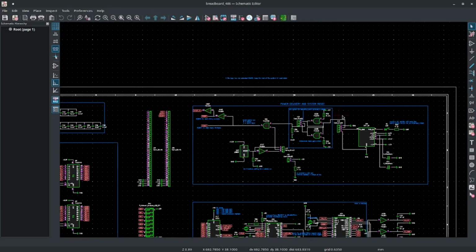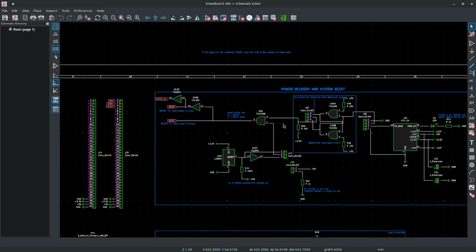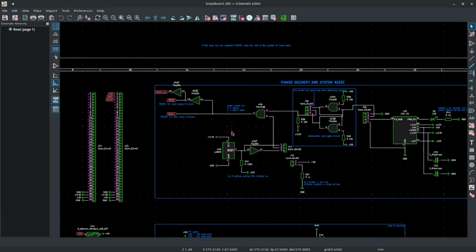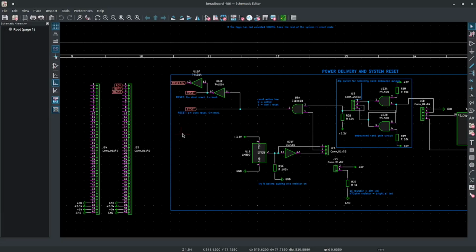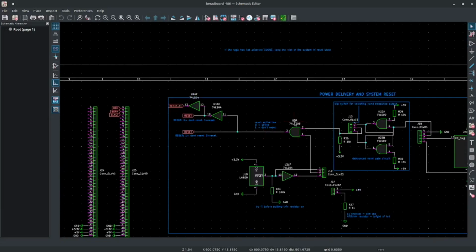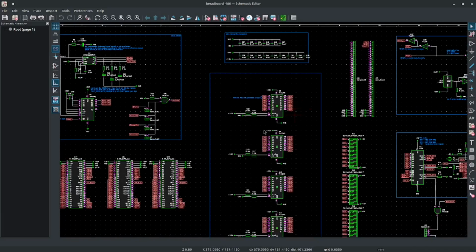The reset logic is going to have to change because the FPGA takes time to start up, boot up, read its data, start working. And it's actually got a C done signal, like a signal that it outputs a 1 on whenever it's ready. So I need to incorporate that into the system reset somehow. Or I could just manually play with jumpers when I get it wrong, which is probably what I'll end up doing, but I bet I can get this to work. I mean, I had the automatic reset circuit actually working on this current iteration, so I bet I'll get it working.